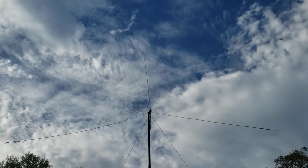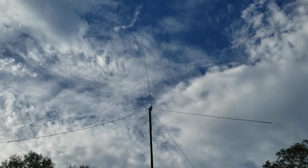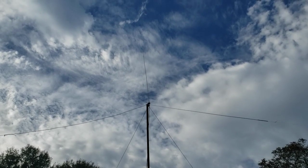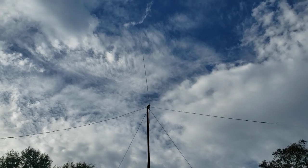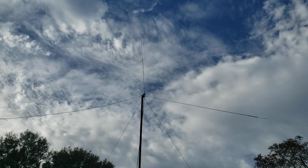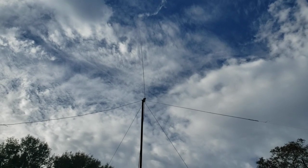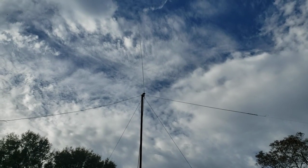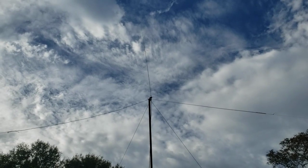Well, it all has to do with ground reference and a plane of ground. When you put those ground radials on — I put four of them out there — and pull them down at roughly a 45-degree angle, it provides the ground reference. Then it kind of acts like a dipole actually. You get a quarter-wave ground plane, which works really well. They have a low takeoff angle, and a ground plane is almost unmatched for local communications on 11 meters.